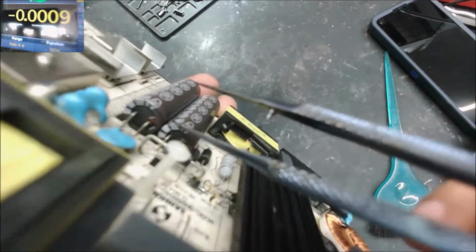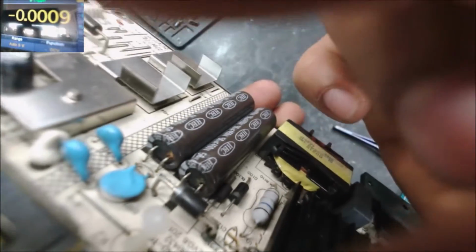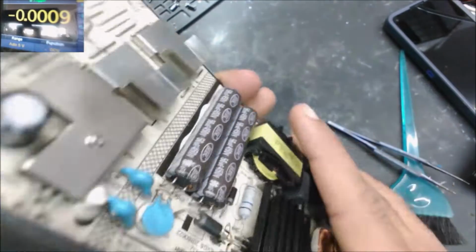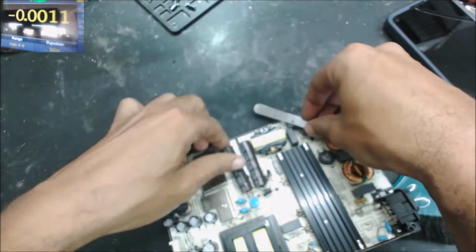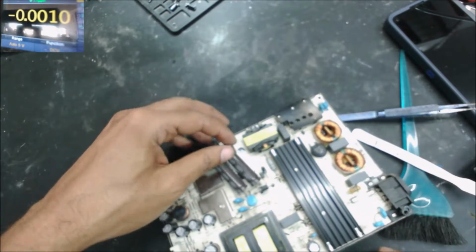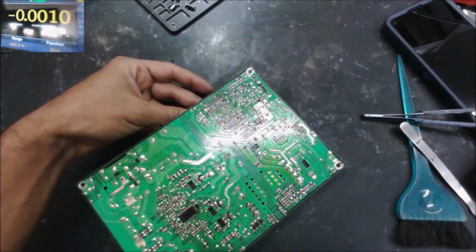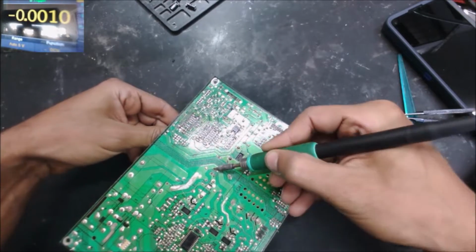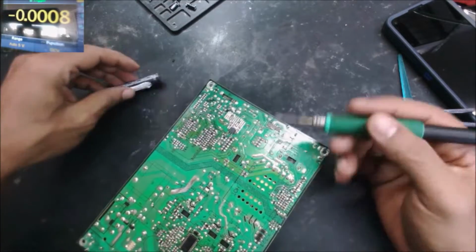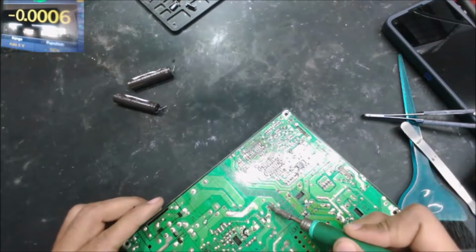But look here, this 2B capacitor looks like it's leaking. You see this brownish? Yeah, maybe that's the problem. Yes, clearly now, there is a leak on the positive side of the capacitor. And the capacitor just has one side soldered. The other side is completely gone. The positive pin is corroded and completely disconnected. Yep, you can see how the capacitor is.